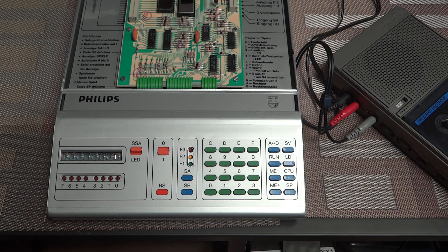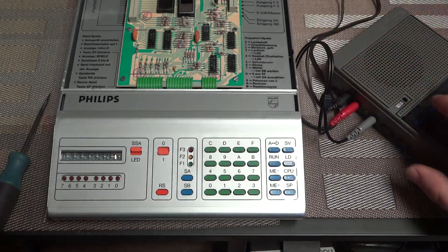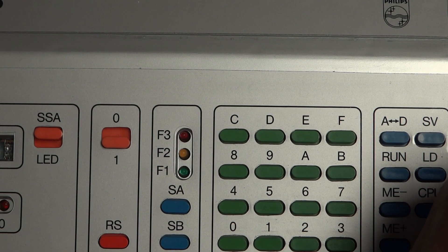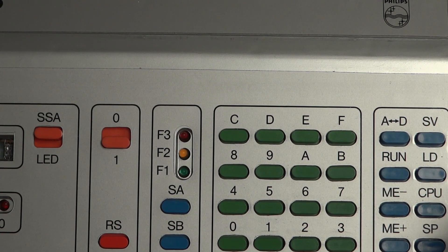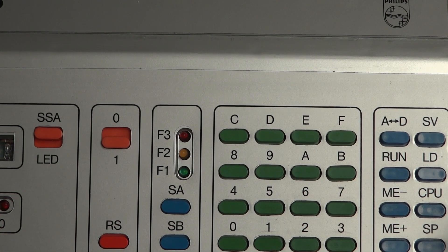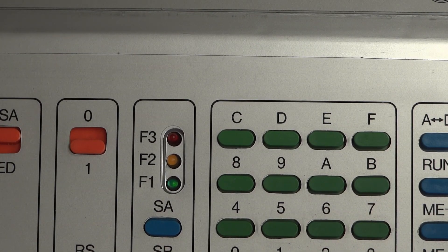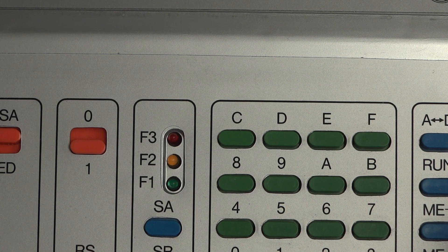Now let's try to read the test tone back. We use another ROM program, SPF, which gives feedback by observing LEDs F2 and F1 to find the right volume level. I start the tape recorder — I can't turn on the monitor or it will interfere. Our goal is to have both F2 and F1 equally lit. If F2 is barely lit and you decrease the volume, it becomes more fully lit — that's bad. Increase the volume until it dims a bit, and F1 the green LED also barely comes on. If the volume is too high, you only get F2. This balance is the perfect level.